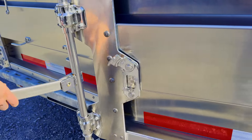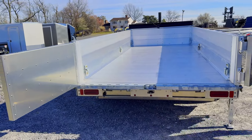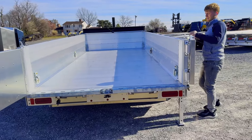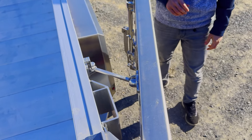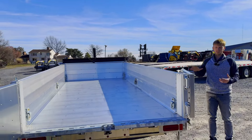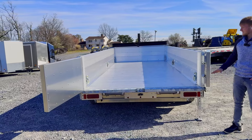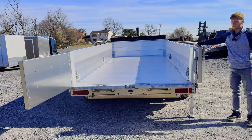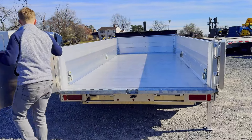Really like this setup. It's a heavy duty latch, a bar lock. Notice the double latches there — you've got your door hold backs. Door hold backs on dump trailers are a very significant piece. You think it's a small little piece, but it's very important. If you end up dumping and your doors unhook and swing forward, you bend them, you break things — it's a real pain. Small but very important piece. Really like that on the EB dump trailers.